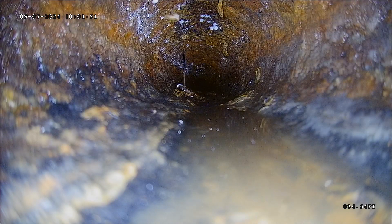Now we're transitioning to cast iron. This might be the weakest link. Cast iron gets real rough and rusty — eventually it will need to be replaced. I've certainly seen a lot of houses of this age that have already had to replace it, and this is looking pretty rough. Waste can get stuck in here a lot easier — it's not as smooth. We also have some standing water, which could be caused by how rough the line is, but it could be caused by bad grade.